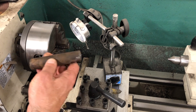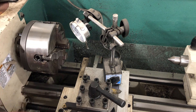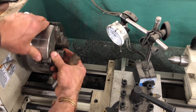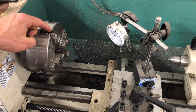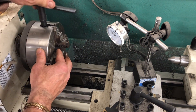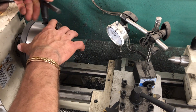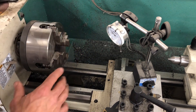I have this random chunk of metal here. I want to get it turned down just a little bit, maybe drill a hole in it. So the first thing I need to do is back off my carriage and put my stock in here. I want to get each of these jaws to where they're essentially in the same spot. A lot of times I'll just hold my finger and try to get them flush — so those are all essentially in the same spot.